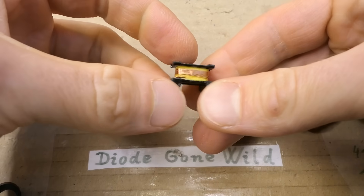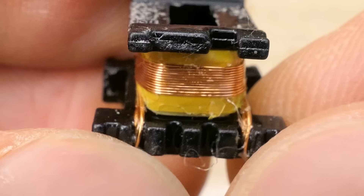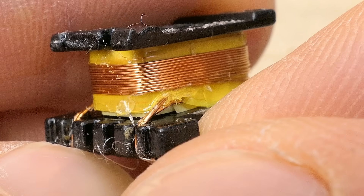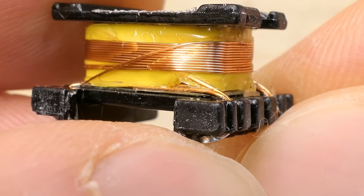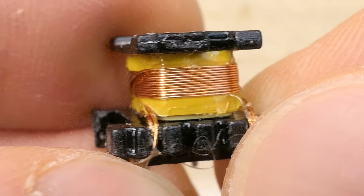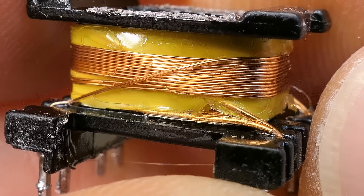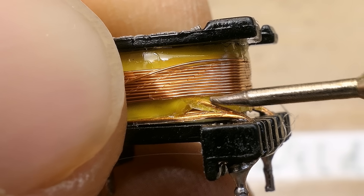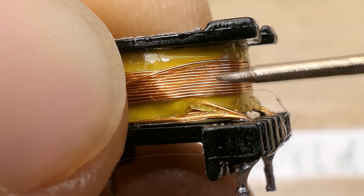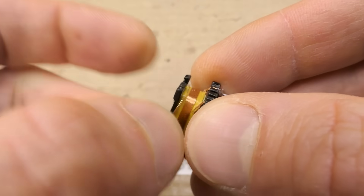The auxiliary winding is connected with the primary side, the main side, and here it's quite close to the secondary, which is connected with the output. The insulation is a bit molten here, the windings are getting very close, and it would probably get even more molten if it was running for longer. This is the worst spot — here it's getting super close. The tiny gap between this wire and this winding is basically the gap between the mains voltage and the user — between the user and death by electrocution. And that's about how much the makers care about the life of the customer.